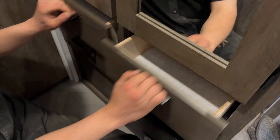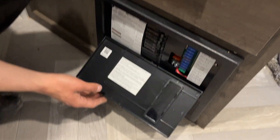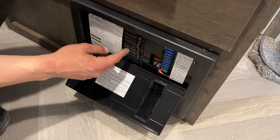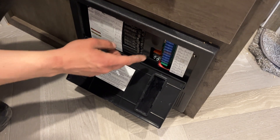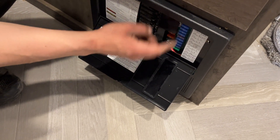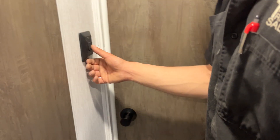There's also the rear entry door from outside. Closet space here as well as all the drawer space. For the converter, press the top and center to pop it open — all your breakers are in the middle. Whenever a breaker trips it sits in the center, so just turn it off and back on to reset it. All your fuses are on the right side — whenever a fuse pops you get a little red LED right beside it letting you know exactly which one went.